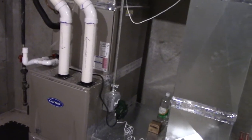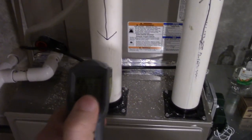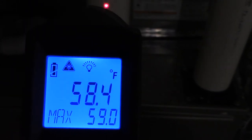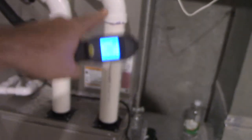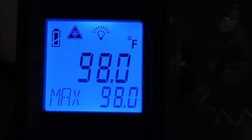We'll start with the intake and the exhaust ducts and give some temperature readings on those. The intake is outside air, so that's why it's pretty low — about 14 to 15 degrees Celsius and 59 degrees Fahrenheit. Now the exhaust duct — I had told you this never really gets too hot to touch, and you can tell they're using a PVC pipe. About 36 degrees Celsius and 97 Fahrenheit. The hottest I ever saw it get is like 102, so like I said, this exhaust duct is really safe to the touch even when the furnace has been running for a while — pretty efficient in that regard.